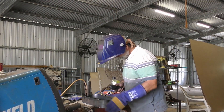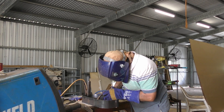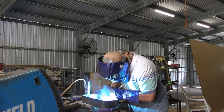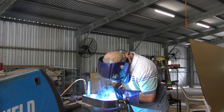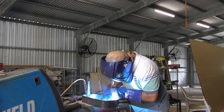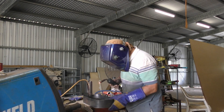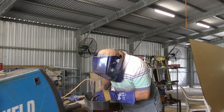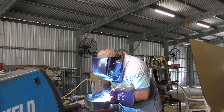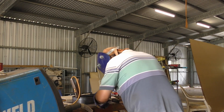I wanted to keep it nice and neat without deforming it too much. The port light needs to fit into that box frame, and any major deformation from welding up big gaps would make that process more difficult. All four of them went really well, and as you can see I'm welding the back side of the inner ring in position now. The overall shape and dimensions of these box frames came out quite well, so at the end of the day I was very pleased with them.